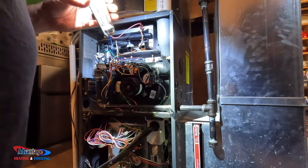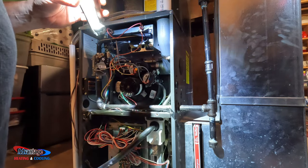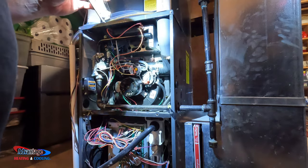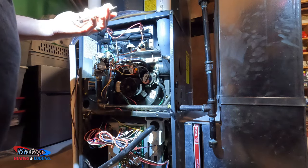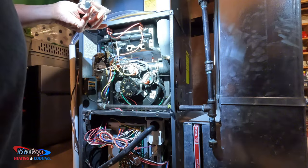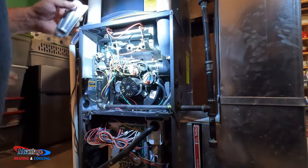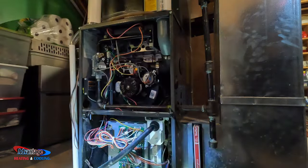So I'm gonna get you an estimate on replacing these burners with stainless steel. That may clean up the way it's burning, and I know it will clean up the way it should be burning blue and is burning yellow. So that's the reason why it's burning kind of dirty, is because these burners are aluminized steel. And you know what happens with aluminized steel when it gets wet? Moisture starts rusting. But definitely on propane, stainless steel is the way to go. Yeah, because they've only been in here 3 years. Yeah, it doesn't take them long.